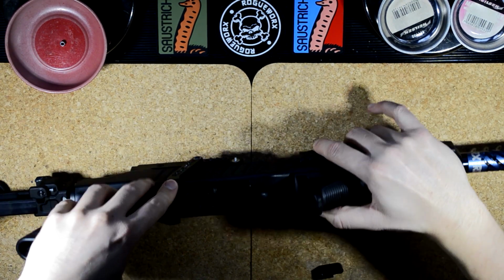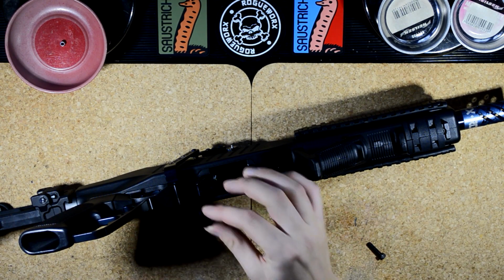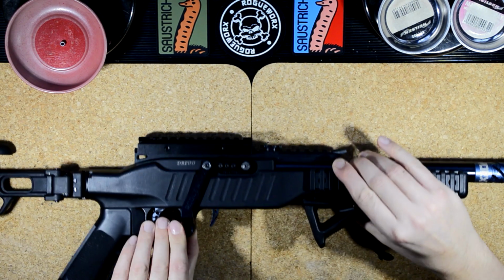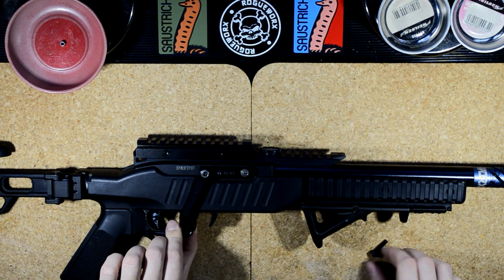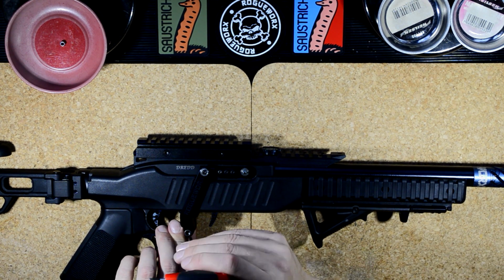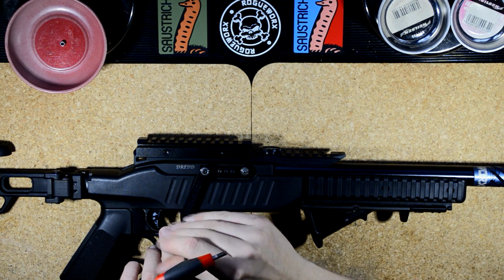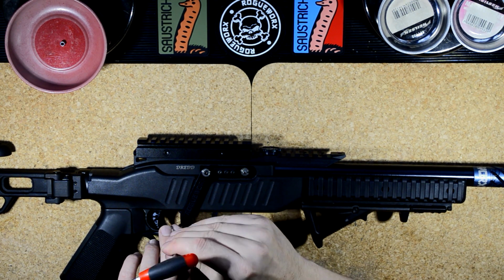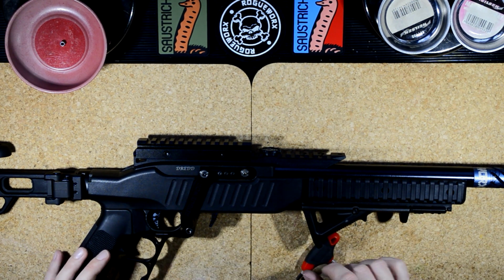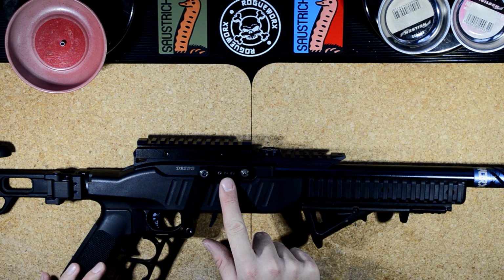So first you're going to want to put the clamp on the other side, like that, so it sandwiches either side of your trigger mech. Drop the big M5 20mm screw back in. Tighten that up so it clamps onto your trigger mech, and then you can see that now has that pivot point sorted, and you can see this bar here is moving.